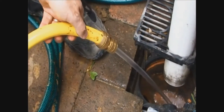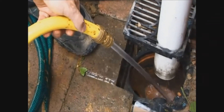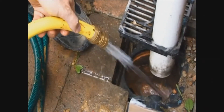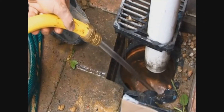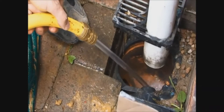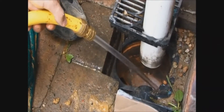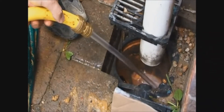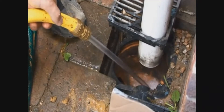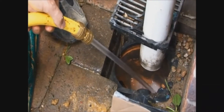Now we're going to pump the brine in. The brine goes in behind the water and simply just pushes the water out of the system as the brine fills up the system. This is the water that's coming out that we're pushing the brine in behind. Eventually this water will turn to brine — you can see at the moment it's just clear water. But you will notice eventually it will go from clear water to a red liquid virtually instantly.